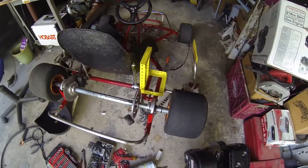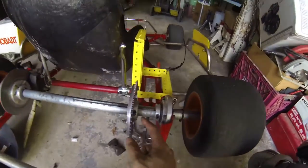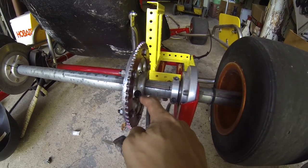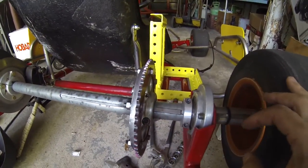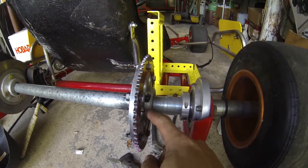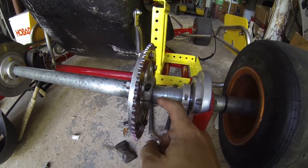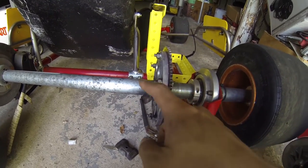Unfortunately I'm going to have to cut this episode short. This sprocket right here is just stuck on the shaft and no matter what I do I can't get it to come out. The bolt is stuck — I believe it's a 7mm hex — and it keeps slipping. I even tried heating it up, because this is steel and the housing is aluminum, and aluminum expands faster than steel when heated, so I was hoping to convince the bolt to come out with a torch. No luck at all.